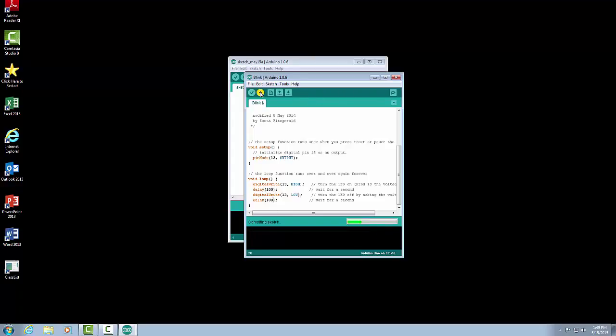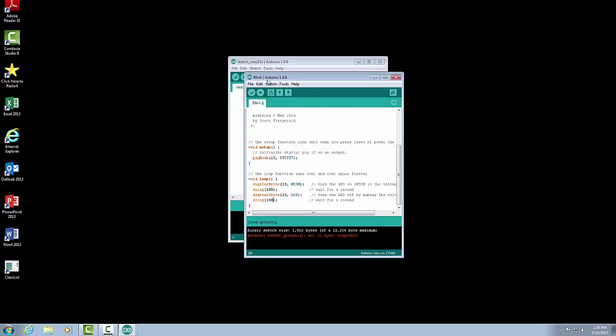If I hit upload, it will compile the sketch, but it won't be able to download it because it can't find the Arduino because it's on the wrong COM port. So you can see that it's compiled our sketch, and now it's trying to upload, and it says done uploading, but we get an error. This AVRdude, it says not in sync. That's the error that you'll get when you have the wrong COM port. So if you get that error, go up under Tools, go to your serial port, and select a different COM port.